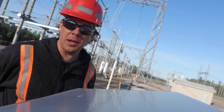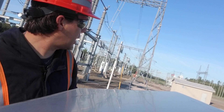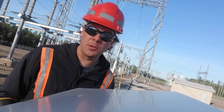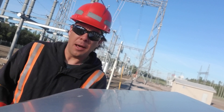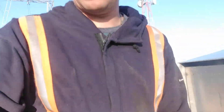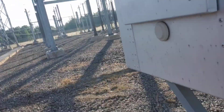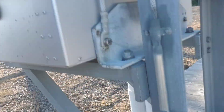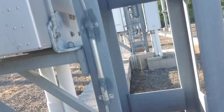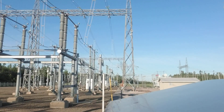There was a discussion at the office the other day about using rubber gloves when opening our gate into our substations and terminals. And I don't know if you ever noticed, but inside a switchyard, absolutely everything metal is bonded — every single cabinet, every single steel structure, the gate — everything is bonded together in our terminals and substations.